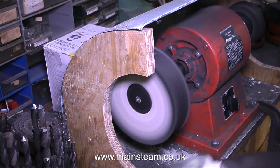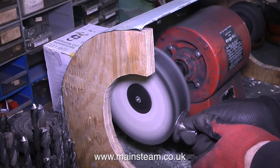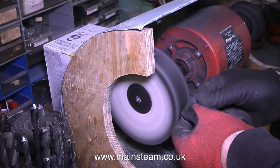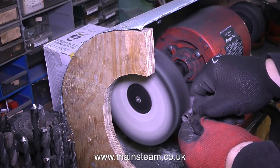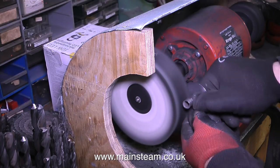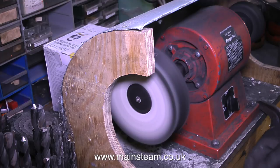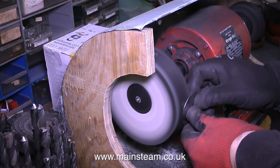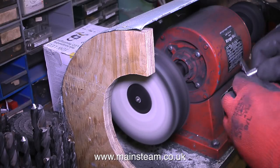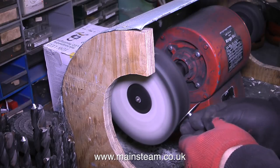The next stage of the operation is using the polishing spindle, and you will see that I'm wearing gloves and hating every minute of it. But there isn't a pot of water right next to the wheel. In my workshop, I have a pot of water so when the parts get hot I just dunk them in the water, but there's no such thing here — and it's also a health and safety thing. I'm wearing gloves because it's the protocol in the workshop. I much prefer to burn my fingers, really. The reason I don't usually wear gloves is that I need to know where my fingers are relative to the rotating components at all times. As you can see by these gloves, my thumb doesn't come right to the end of the glove, so the glove itself could get caught in the machinery and drag my finger in after it. Without gloves, I can accurately see where my fingers are relative to the rotating parts of the machines. Even with these gloves, I can still feel the heat, but it's nowhere near as painful as it is when I hold the part in my bare hands.